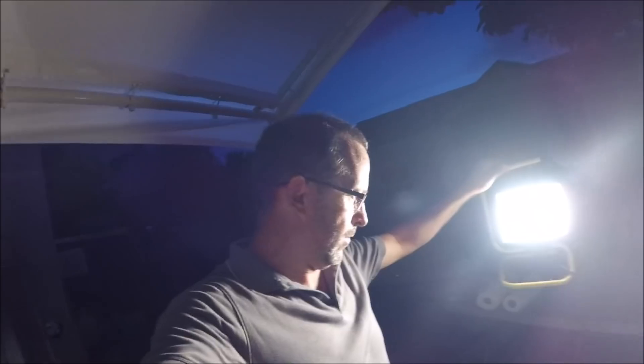Done putting the transom core in — I filmed this at night to show it's done. Here's the outside — it's pretty straight, though there's a slight bow right about here that I'm not sure why it happened. The transom is in, nicely clamped down. All I have to do now is put more peanut butter around the corners where there are some gaps, then put three layers of glass on top, tabbing it out into the hull, and that's all she wrote for the transom. I'm excited to finally have that piece done — it's a big piece of work.